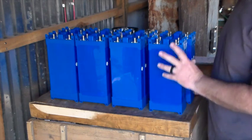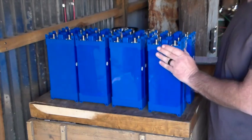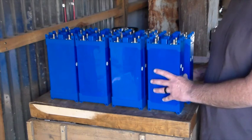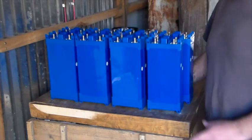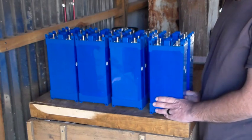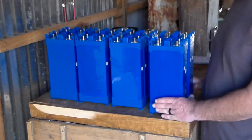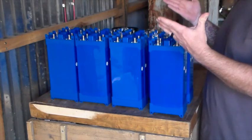So these are my batteries — they are 100 amp hour, 3.2 volt lithium iron phosphate cells, and I've got 16 of them. The correct way to really do this would be to wire them into a 24 volt battery, since I'm going for a 24 volt system. But through my lack of knowledge I ordered 16 to double up as 200 amp hour cells. They sold these in 230 amp hour cells, and ultimately what I should have done is just ordered 8 of those — that would have been more than the equivalent and probably cheaper. But due to my lack of knowledge, this is how I put my system together.